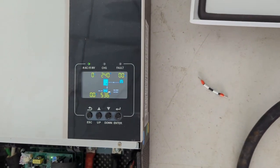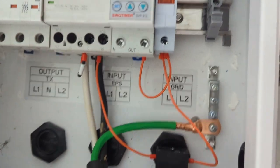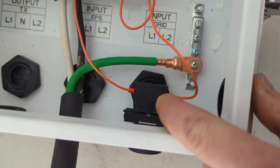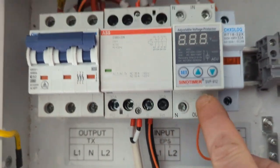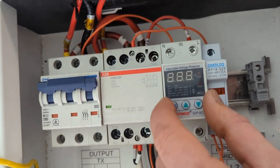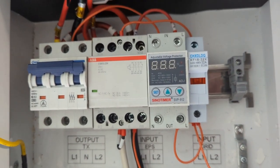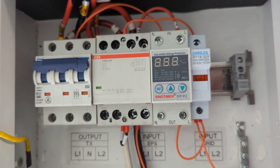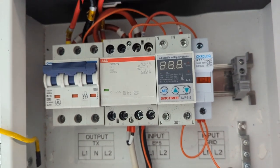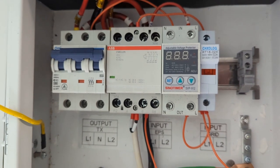Right now the Growatt is turned on but it's not actually operational, and that's the purpose of the momentary switch. What the momentary switch does is it pulls out the other leg and skips the voltage protection relay to initialize the system. This gets you the same result as the video I posted yesterday using the shunt trip breaker. Some people don't want to run a contactor 24 hours a day, 7 days a week because it does draw some current — it's not zero current like the shunt-based system I showed you yesterday.